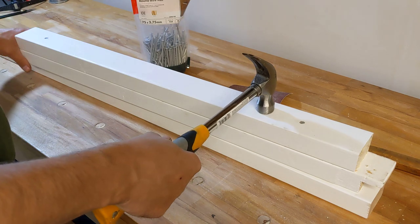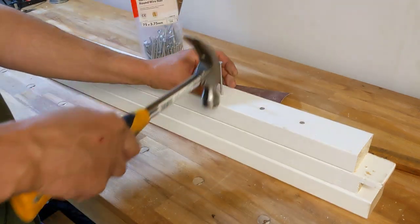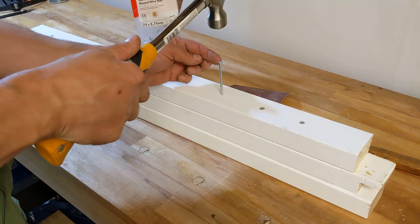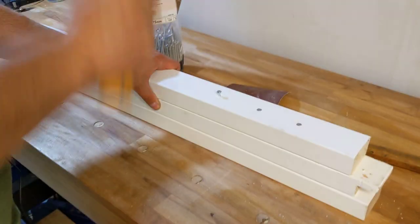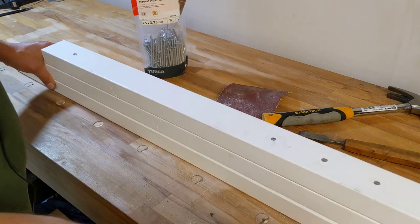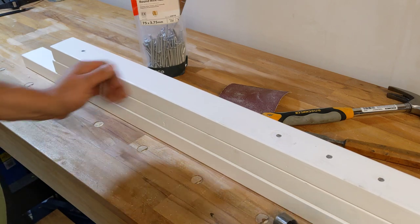You don't want to keep smashing the hell out of it because it'll get hammer rash and that's not particularly attractive. What I'm doing is really thinking of hitting the top but carrying that force down, concentrating on that energy going right down to the bottom of the nail. With the advent of nail guns these days it's not often I use a hammer and wire nails — my work is much more a joinery workshop — so forgive me any professional chippies and site carpenters watching this.